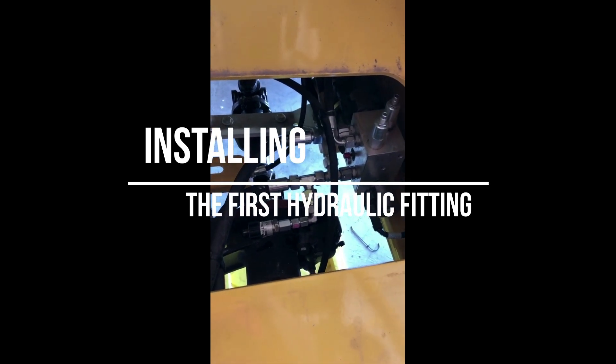And once you have your safety stuff done, go ahead and start installing your pressure transducers. I've traced my hydraulic lines down to a spot where I can install a T. I've installed the piston side one already, and you can see this is where the rod one will go. So I'll break this connection here and install the T. We don't ever want to put the pressure transducers right out at the actual cylinder because they'll be exposed to more potential danger and damage, and also they'll be moving up and down all the time with the cylinder as the bucket moves up and down.